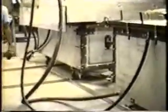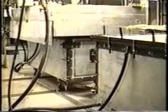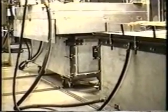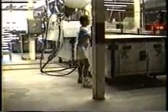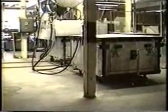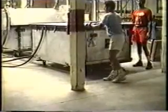We now put in a 36-inch mold while they're unloading the 60-inch tub shower. By the way, all those molds are modular. That means to change from right to left, we don't change the whole mold. All we change is the bottom part. And if you want to make a different back, you can take this back out and put a different design in it without changing any of the other stuff.